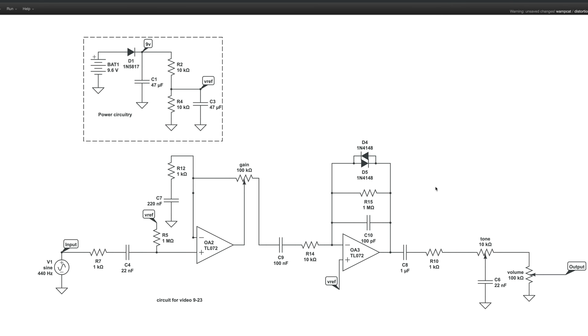The thing with diodes in this type of arrangement - you throw enough signal through it, it can start to really almost sound more distorted, just a smoother compressed type of distortion. It's a really cool thing, actually - it's just a different feel and it's a fun thing to play with. As far as the output section of this expanded version, it's the same sort of thing - we still have the 1K, the same tone control, the same volume control to the output.